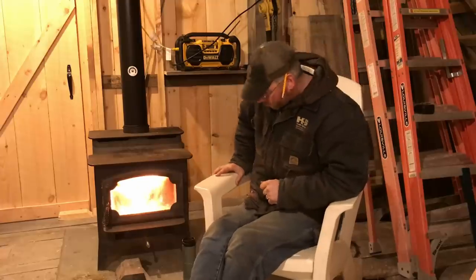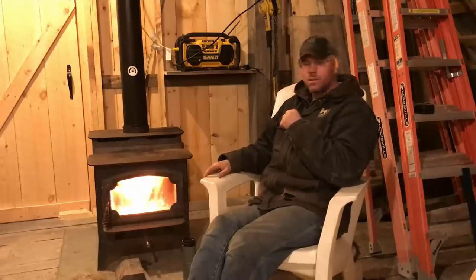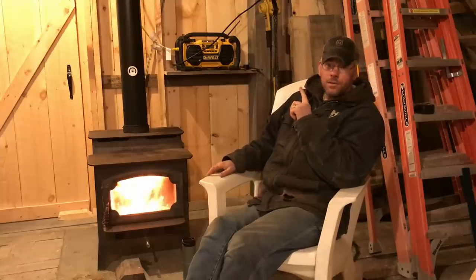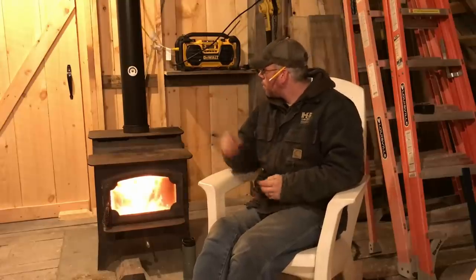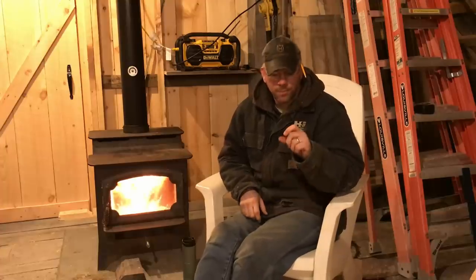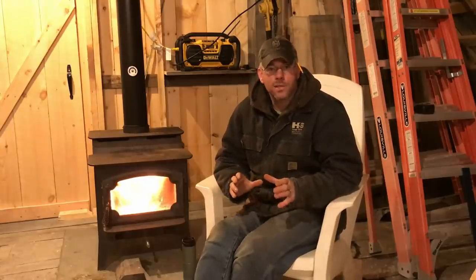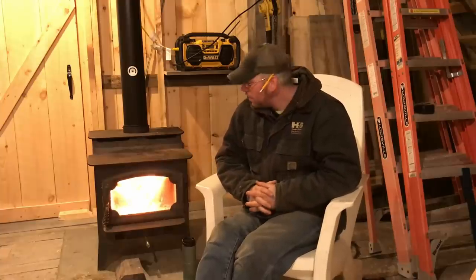Now, as far as clearances go, we only needed 15 inches off the back wall. We have probably a little over 2 feet, so we're fine there. The triple wall pipe requires 2 inches of clearance all the way around it. We have that just fine. The single wall stove pipe requires 18 inches of clearance off of combustibles. And we make that except for where the elbow is. We have a heat shield up there right now. And pretty quick, probably next video or two, we will be making a proper heat shield with K-wool blankets sandwiched in between sheet metal. That's pretty much when you buy a heat shield for something like that, that's what it is. It's usually sheet metal with K-wool in between it. Oh, that will work just fine.